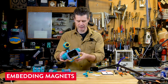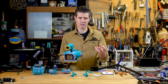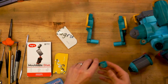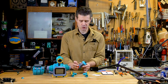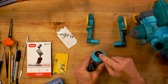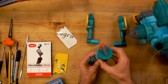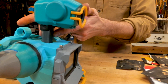One of my favorite tricks to do with Sugru is to use it to embed magnets into projects so that things can click together. You'll see here I've got this magnet embedded into a shoulder cup, and here's one that I haven't done this treatment to yet. On this shoulder canister, I've got a little hole in here and I have filled that with Sugru and then pressed the magnet into place. The benefit of this is that you can then snap things into place and also reposition them a little bit through rotation.